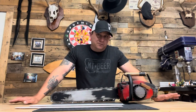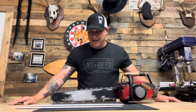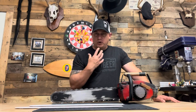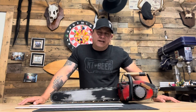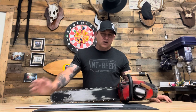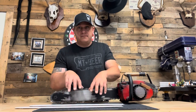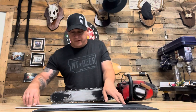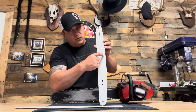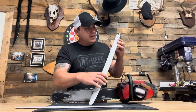That aluminum is what really messes with me — even wearing a respirator, the fumes gave me permanent throat damage, which is why I don't do them anymore. Even doing it outside, having the fumes in the air a little bit would affect me. If you do use that aluminum, please be very safe, do it in a ventilated area, and wear a respirator. When you have your stiffener metal, measure just enough of a gap all the way around so the chain's rigid edge that fits inside the bar has room.